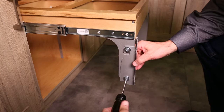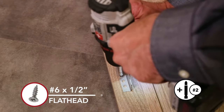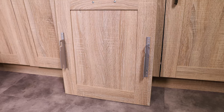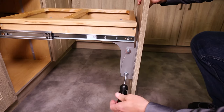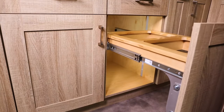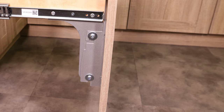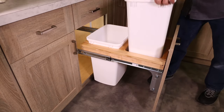Loosen the mounting screws and remove the door brackets. Attach the door brackets using the number 6 by half-inch flat head screws. Hang the door brackets over the mounting screws on the frame. Tighten the bottom screws first. Close the unit and firmly press each corner of the door, then carefully re-open from the bottom to keep the tilt from coming out of alignment. Tighten the top screws. Minor adjustments like skew and tilt can be made on the bracket mounting bolts. Your installation is now complete. Enjoy your product for years to come.